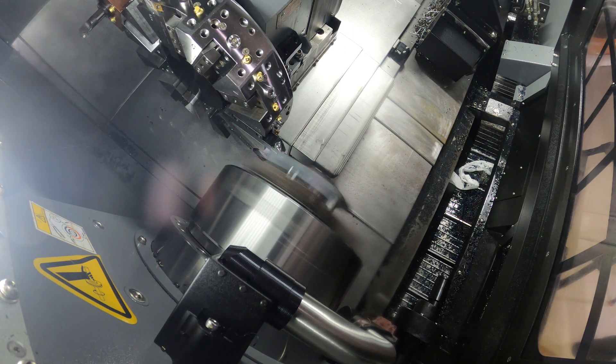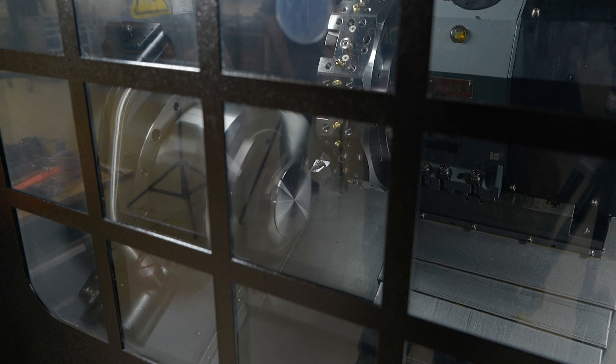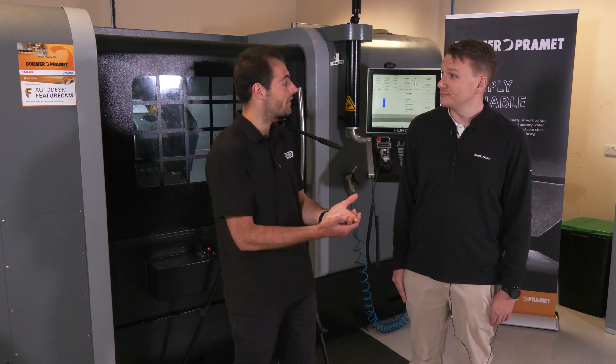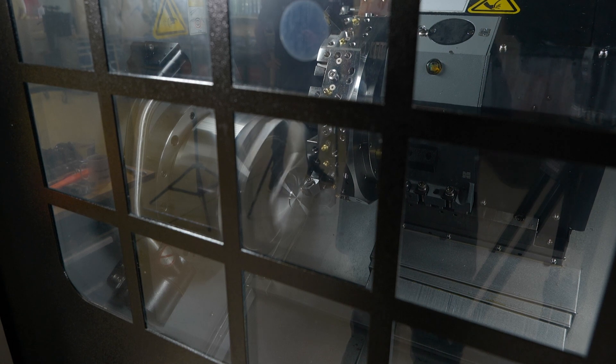If someone gets this grade on their shop floor today, what could they use it for? Primarily for steels — you can also do a bit of stainless and cast iron with it. But if you're doing a lot of steel turning, you'll get great performance. As mentioned, about 80% of lathe work is generally steel, which is exactly why we've gone with the T9405 and brought it out into the marketplace. It's a real workhorse of a grade.